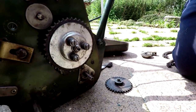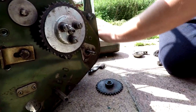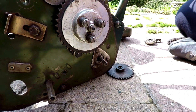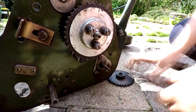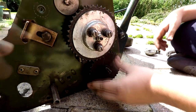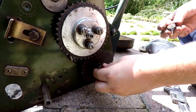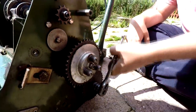Can't that spin that shaft round? That's the drum. So we can see the woodruff key now. So that can go in there. That'll be fresh between them teeth there — that's on. We don't need to put the tensioner on yet. Was there a big nut that goes in there? No locking plate or nothing? Just a thrust washer. Oh, that's right — it was a nylock nut, wasn't it? It's all coming back to us. So far, so good.